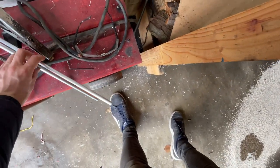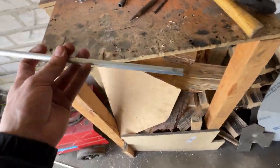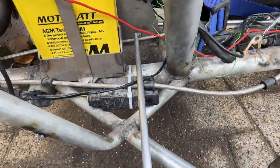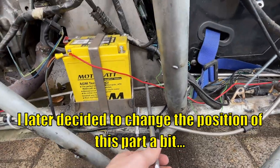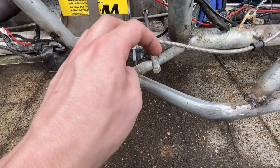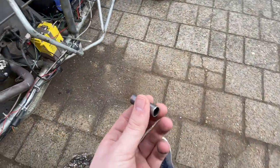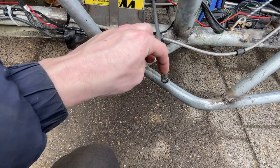So we just put them like there. The point is this shaft goes to the center - this is actually the shaft that gets pivoted. I have the hole over there, as you can see. There's holes on the other side as well. I've flattened these pieces so it's easier to drill and tap. And then like I said before, these sleeves - I'm going to drill a hole in those as well, just go over there and I can just attach them to each other with a screw.